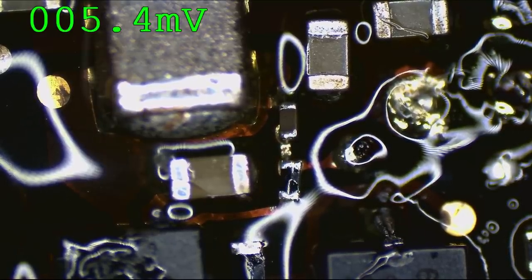Yeah, he replaced the entire circuit. I still don't know why we don't have 3v3. That is mind-boggling. So what are you thinking the problem is here? I'm feeling like there's an internal short somewhere in the circuit. How would you tell? Internal short in input, output, feedback trace? Well, output, because we have input but no output. And I'm about to inject 3 volts into it and see what gets hot.